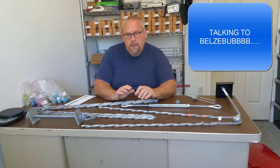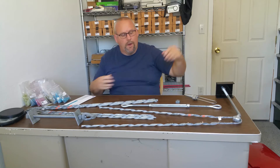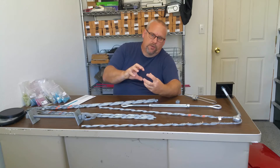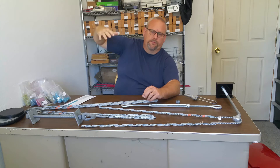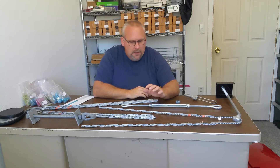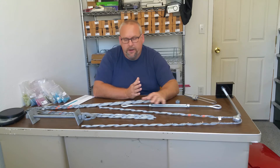If you go out to your power poles you'll see two types — non-isolated and isolated. Non-isolated is a continuous wire, which is what I'm doing here. Isolated has a big ceramic square isolator — at least ours do in the northwest — and that's used when the guy wire goes up and crosses the line or is near the high voltage. So this is going to be a non-isolated guy wire setup.